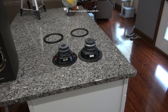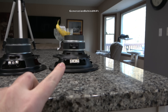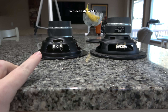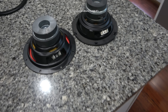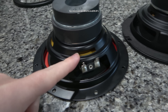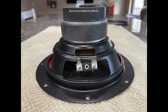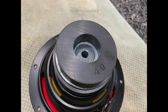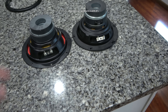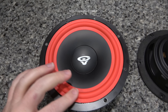The woofer on the left is from my Cerwin Vega LA165, and the woofer on the right is from my Haco Aurora 700 floor standing speakers — do you see any similarities? A bucking magnet is another magnet placed on top of the main magnet with opposing polarity. That opposing polarity cancels out the magnetic field generated by the main magnet. This design was commonly used in speakers back in the 80s and 90s so they could be placed next to a tube TV without interfering with it. Bucking magnets can also increase sensitivity slightly and lower the speaker's QTS, also known as Total Q. Seeing a woofer utilizing a bucking magnet is quite the rarity today.